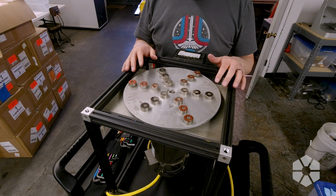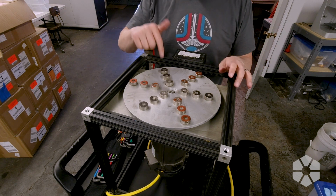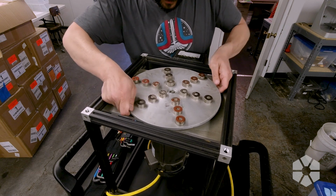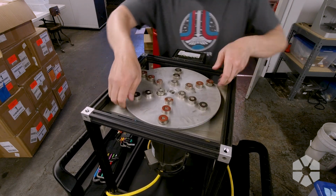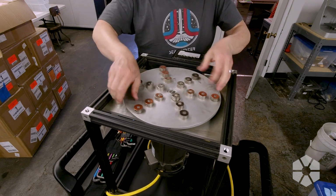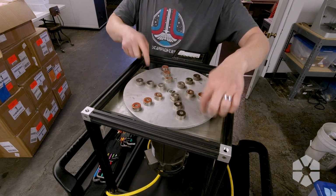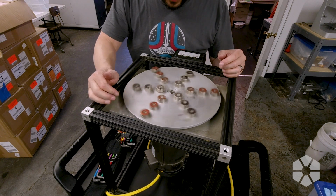This is actually a manufactured disc for like a rotary sander, which I just bought and then machined pockets and everything for all these magnets. It didn't quite fit the shaft properly, so I made a sleeve to fit in between the shaft and the plate, and it does not want to come off. I was just hoping I could encourage it off. If I use a puller, this thing's actually pretty fragile. I don't want to fold this thing up like a taco or make it wavy.